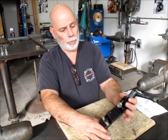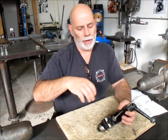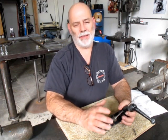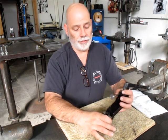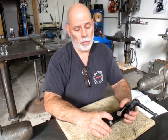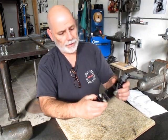It served me really well and it's handy because you can move it all around and point it at any angle you want and change the height really easily. I've never liked those kinds that sit flat on the table where you wiggle the rod up, slide it, and it's all done with set screws — in my opinion a very weak design method for retaining shafts. This is my interpretation of what I saw from Royal Products. I don't think they sell them anymore, but we're going to zoom in, take this apart, see all the different components, and talk about work stops.